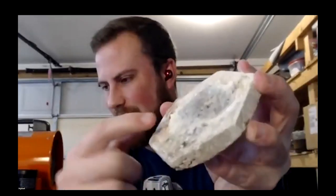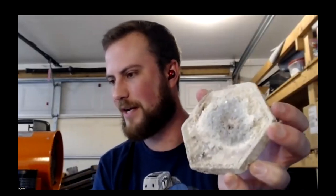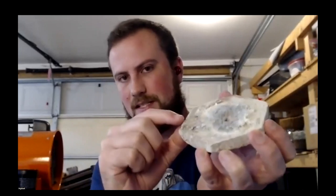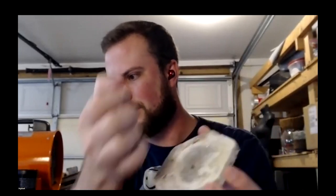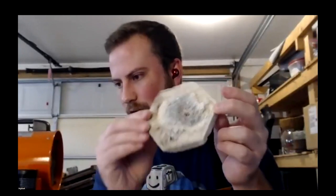Inside the middle, if you can see, is a silicon carbide element, which I printed roughly like what you'd see on a grill. It's nothing fancy. You could print it in any kind of shape, or if you just had silicon carbide powder, you could inlay that. A castable refractory layer was cast on top of this, because this is just a standard coaster mold. So it was filled, and now if I put this in the microwave, this is the heat source, and it's insulated. So you don't have to worry about the silicon carbide crumbling out of your crucible.